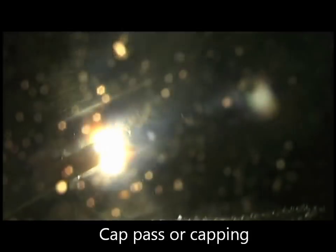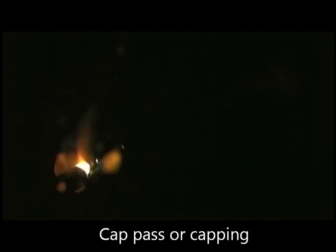All right, we're going up the other side now. Again, you can see the edge of the rod, the bottom of that 7018 rod, is just about aligned with the bevel when I oscillate it, and then I let the puddle kind of fan out whatever it wants to past that, which is roughly a 1/16 of an inch. 1.6 millimeters for everybody else in the world.